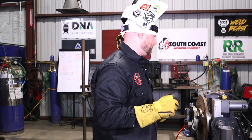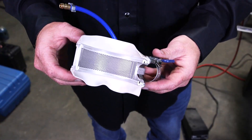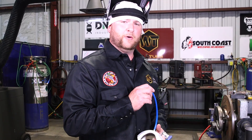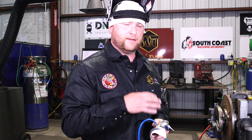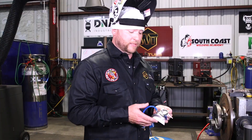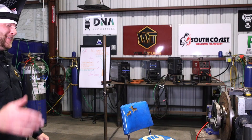We're going to use our Titek Industries 3-inch trailing shield. It's going to give us about a third of the pipe shielded at all times. So if done correctly, this whole entire weld should be completely chrome-looking — no color at all, not even a straw color. Straw is a light tan and is about the only color that's really allowed in titanium. If you weld anything with blues or purples, it's a no-go — it's an instant fail. Chrome to straw is what you're looking for. I personally like no color at all.